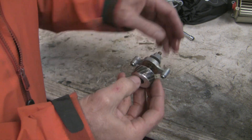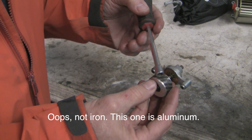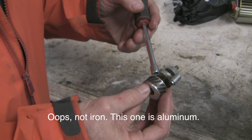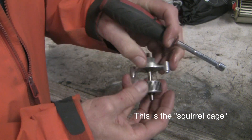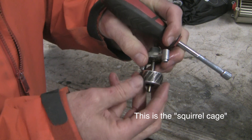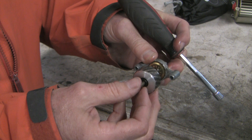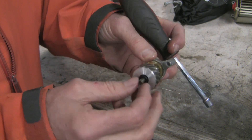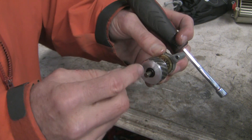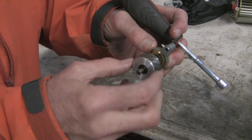Let's have another look at the rotor. These rotors are interesting — they have metal bars, either iron, copper, or sometimes aluminum, going lengthwise at a diagonal. They conduct electricity, and when the electricity gets to the end cap it equalizes and then comes back on the opposite angle. It's that electricity that generates its own magnetic field, which in turn is pushed by the magnetic field of the primary coil. An inductive motor creates currents in the rotor, those currents set up a contra-magnetic field, and the two magnetic fields interact to spin the rotor.